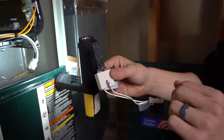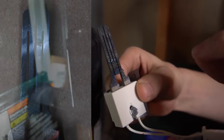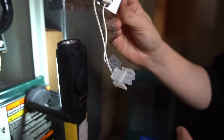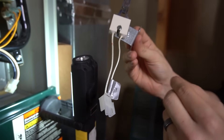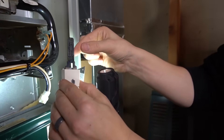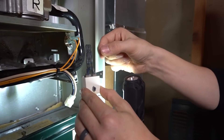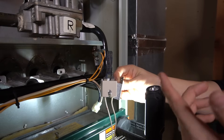Remember how I said you can sometimes visually see if they're burnt out? Most of the time there will be a little crack on the bottom side of the igniter — a white burnt-out line going right through it. If you see that, your igniter is for sure bad and needs to be replaced. Sometimes the new igniter will come with a different plug — don't worry about that. Just snip the plug off the old igniter and wire nut it onto the new igniter, then reuse that same plug to plug back into your furnace. Keep in mind they're very fragile, and don't touch the actual igniter part with your fingers — it'll leave oil residue that creates a hot spot and will burn out faster. Just touch the ceramic part or the bracket when installing it.